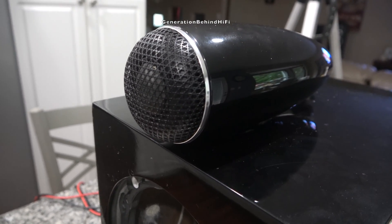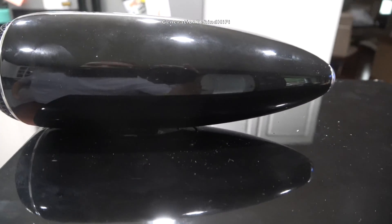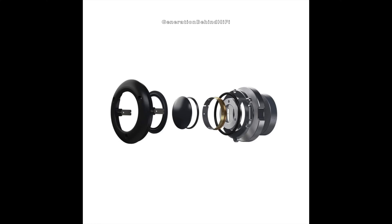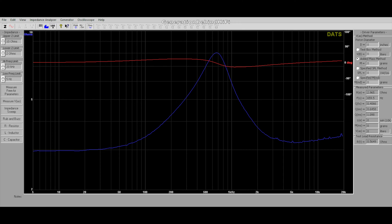The 705 S2 uses a tube-loaded tweeter design, which has been around since the Nautilus series from the late 90s. The tweeter housing is made from a solid block of aluminum — very well built and super quiet. The tweeter dome is made from carbon, combining aluminum with a thin layer of carbon over the dome to increase stiffness. B&W claims this raises the dome's break-up frequency to 47,000 Hz. For comparison, the 800 series speakers using a diamond dome tweeter have a break-up frequency of 70,000 Hz, though a lot of these specs are mainly for marketing since humans cannot hear beyond 20,000 Hz.